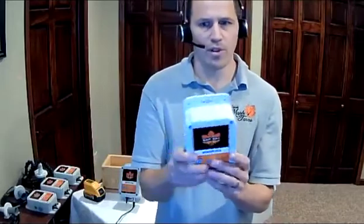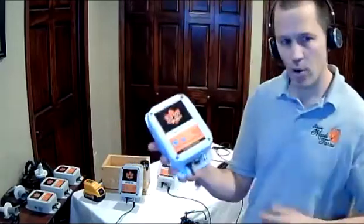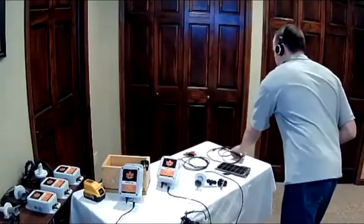As far as power, this device has an internal rechargeable battery. So if you don't have power right at your tank, this device still works fine. It does not require power. In that mode, the internal battery will last about 2 to 4 weeks without recharging completely by itself. When it does not have power, it'll take readings every 5 minutes and then make those readings available on your phone, on a web page, every 20 minutes. So pretty active readings.